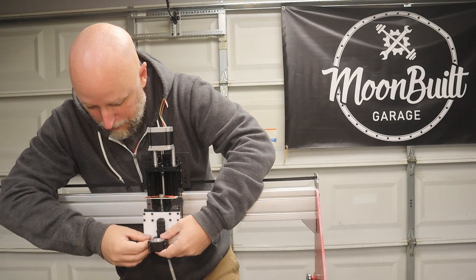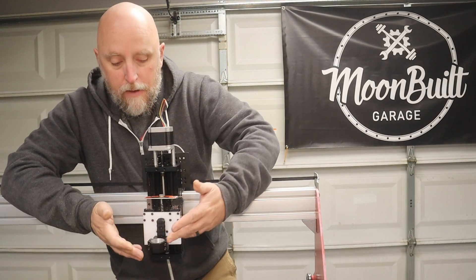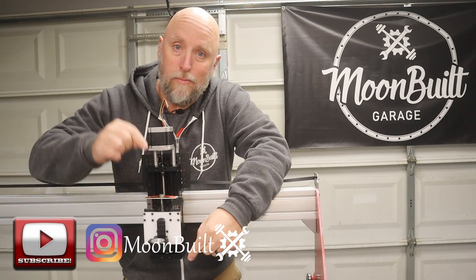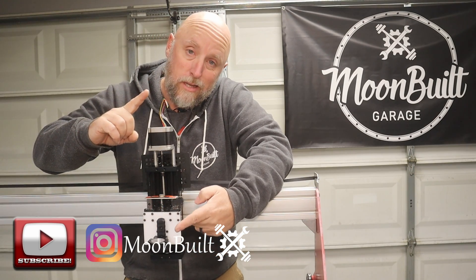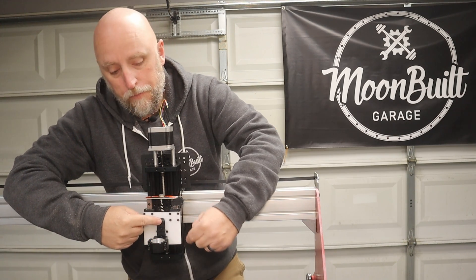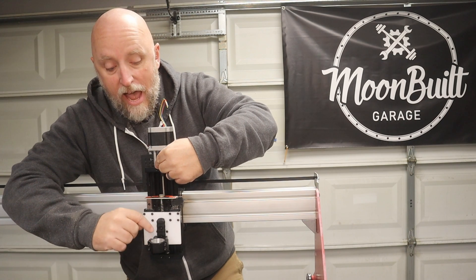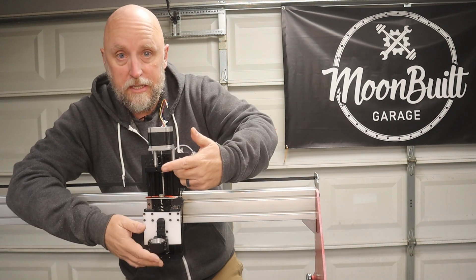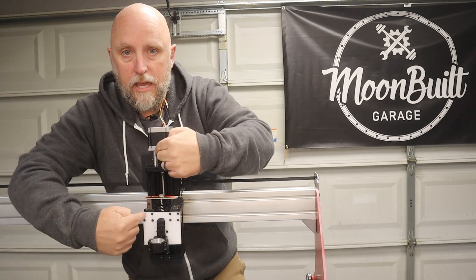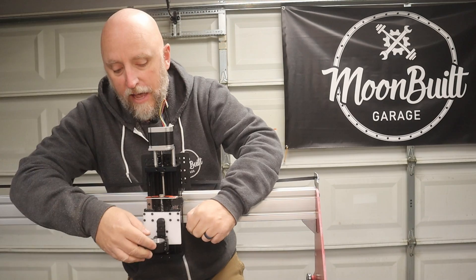It's just a matter of sliding this up on the Picatinny rail and tightening it down to where you need it. What I also like about this is if I ever decide to get an actual machine torch — which tends to be a lot longer — I can always increase the length of this Picatinny rail and extend it up. I can have a clamp here and another clamp up top, which will really help keep that torch head from racking.